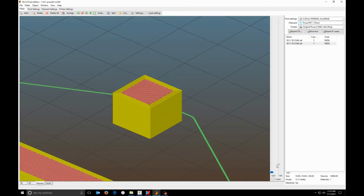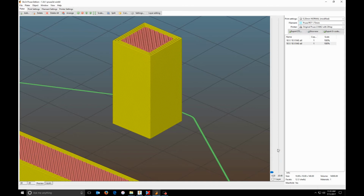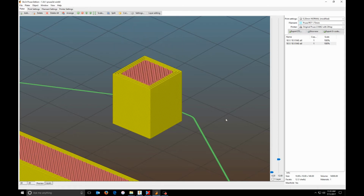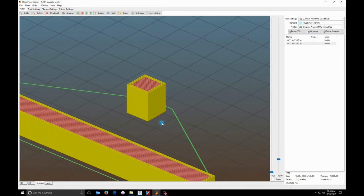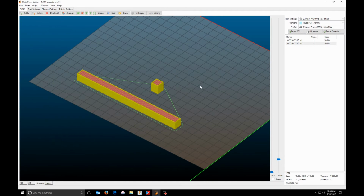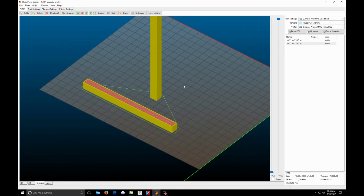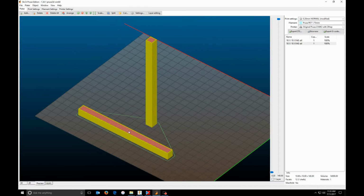Now if you look here, as I stack these, the only thing that you're depending on in the adhesion is however well the material came out of the extruder and then melted to the other layer. So all the strength in this piece I'm showing you here that I'm going up and down with depends on how well the material stuck to the other material as it comes out of the extruder. So lengthwise, you have a whole bunch of layers almost like plywood, and that's where you're going to get your strength. But when you go vertical with the piece, it's completely on the adhesion.